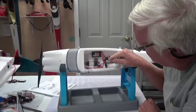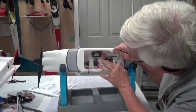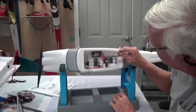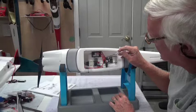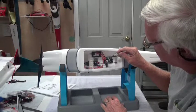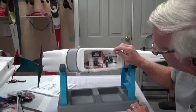This part of the ESC has a little magnet donut on it. It goes through the switch and then into the second port of the receiver, called the throttle. The orange, red, and brown wire here — the orange is a signal wire telling how much the throttle has been moved, the red is hot voltage at five volts, and the brown is the negative.